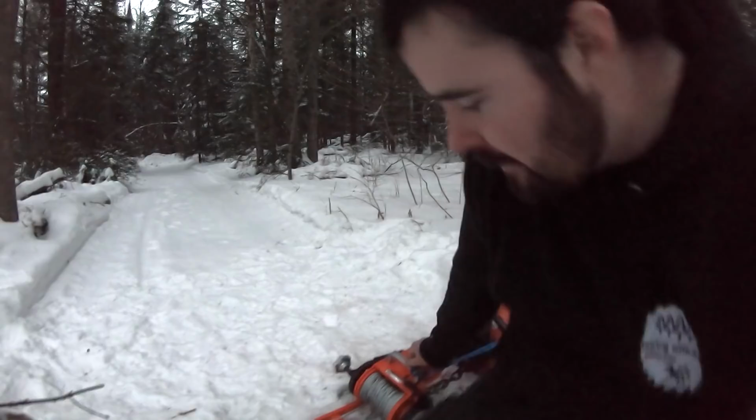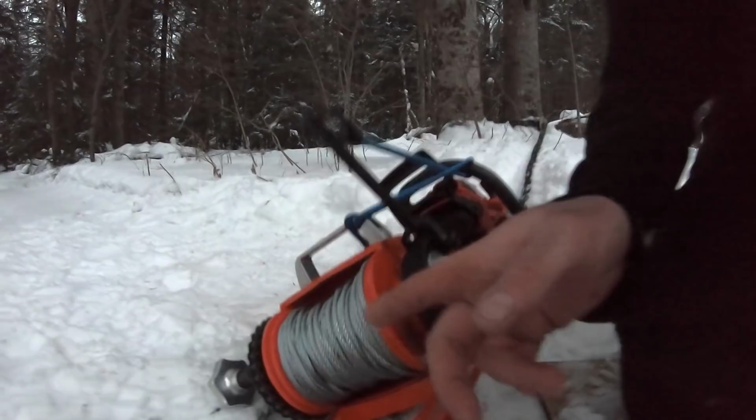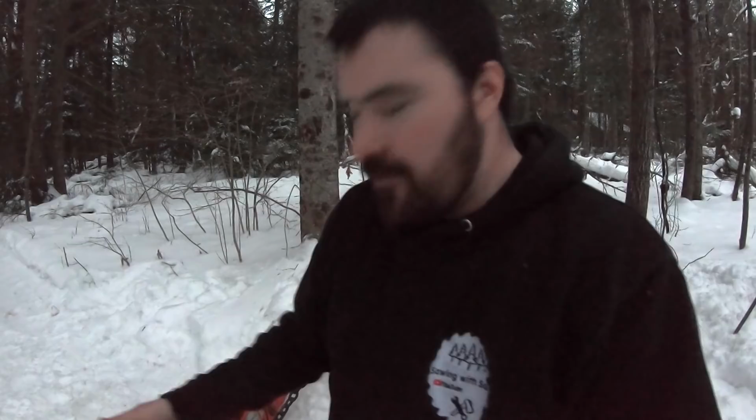Some other things I did notice is this. That bird's nest, this is a bit of an issue. So if you think you're gonna run a whole 150 feet and not have a bird's nest, well, you're definitely better than me. That was a real pain. So that's gonna get dealt with. I'm sure if that cable was put on that spool perfect, and I guess I can't do it, maybe it wouldn't touch the edges. But when you're towing something or hauling something like these logs, you're not exactly guiding it onto the spool. You're sort of putting it where it goes, right?